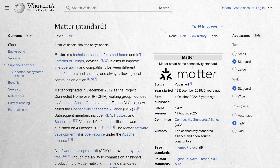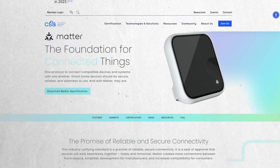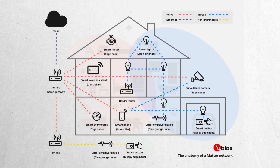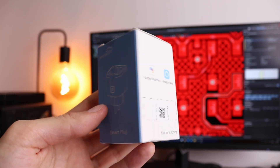Now when I can flash the chip, I can finally start working on its IoT functionality to control the LEDs from my phone. There is such a thing as Matter. Matter is an open-source, royalty-free smart home standard developed by the Connectivity Standards Alliance, formerly ZigBee Alliance. It ensures devices from different brands can seamlessly work together. It defines a common application layer over Wi-Fi, Ethernet, Thread, and Bluetooth to unify setup, control, and security across IoT ecosystems like Apple HomeKit, Google Home, or Amazon Alexa. Usually Matter devices have a special logo on them, and my initial plan was using it.